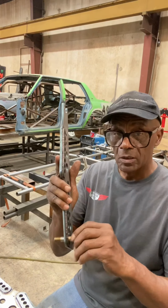Let me get this bolt here. Okay, I use a cordless drill. It's got a reamer on it. It's just your basic setup. What you do is you get a little bit of cutting oil. Everything we're doing, you can do in your garage. Put a little bit of oil on it. Then you line it up with the hole, and you ream every one of these holes.